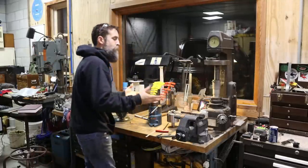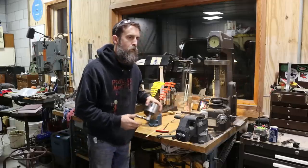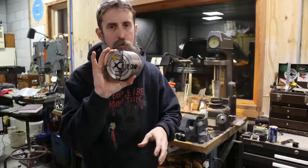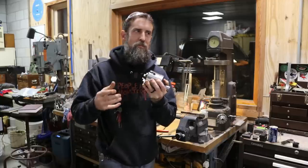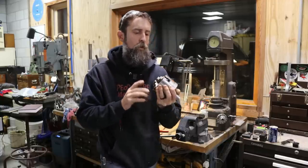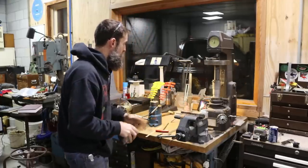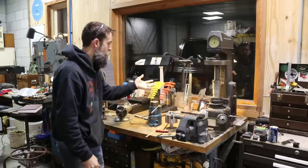All right, ladies and gentlemen, boys and girls, children of all ages, I guess that's it this week. A little longer video than what I normally do, but I think it was worth it to finish this off in one go. Simple item, but man, that adds a lot of versatility to the shop. There's been a lot of times where I wanted to offset grind, but I didn't want to have to cut a custom collet to do a one-time deal. This allows me to hold anything and offset. Odd-shaped items, and it will go in any of my 5C collets, so any of my 5C collet fixtures, that is.